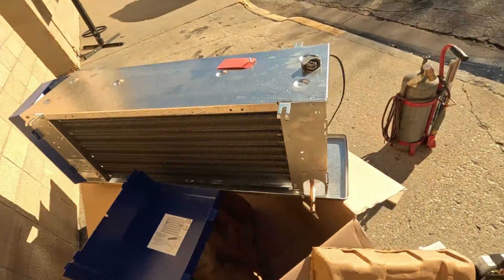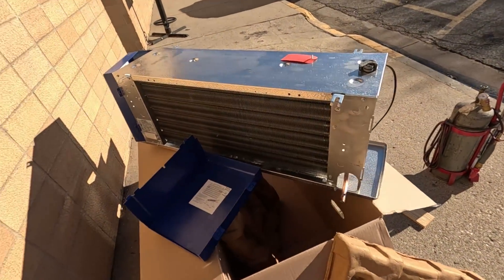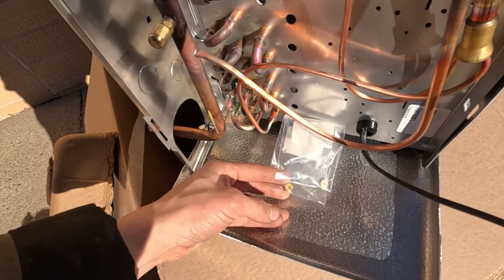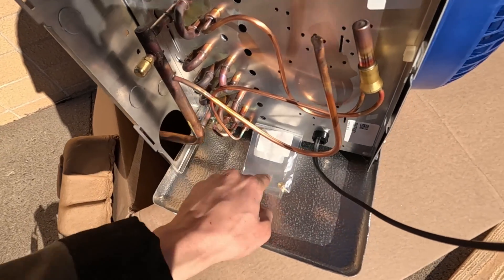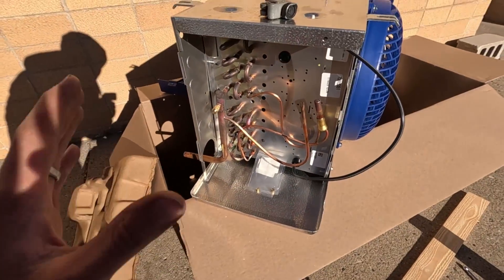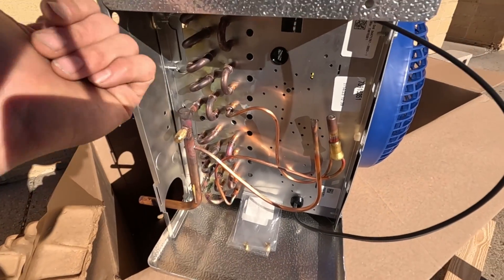We don't have to replace the condensing unit yet. If you've got the money to replace both, maybe that's a good idea, but this way they can get a few more years out of that condenser. When the condenser does go bad, you'd probably put in a new one using a modern refrigerant like R449A or R448A, and you'd have to change the expansion valve at that time as well. We'll actually leave the other nozzle in the evaporator so that when the system gets swapped, they can cut the valve out, pull that nozzle, and put in the proper size one.